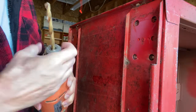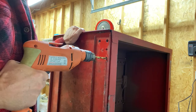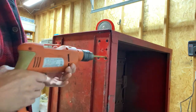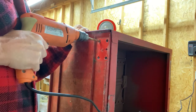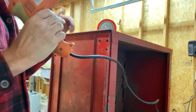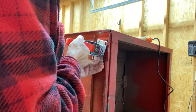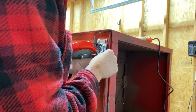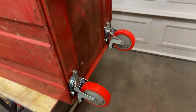The reason I'm having to use that drill is because I tried it with a cordless drill and the steel on the bottom of this cabinet is so hard it was making my cordless drill stall. As you can see, the hammer drill has no trouble at all. Once you've drilled the holes I recommend that you deburr them on the inside of the chest and then test fit your new caster. Inserting the bolt with the three washers used as spacers can be a little fussy but have a little patience and you'll get it done. Now I've got two of the bolts in and I'm testing the caster to make sure it rotates completely. All we need to do then is drill all the rest of the holes and bolt the rest of the casters on and we're done.